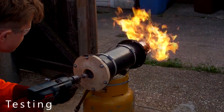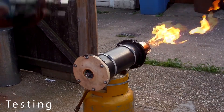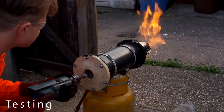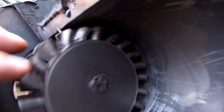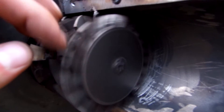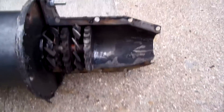The approach you'd need to make it work is to spend as much time and energy as possible on balancing the turbines — even the impeller I bought needs to be balanced. Everything needs to be perfectly balanced, because the main problem was that vibrations caused by the off-balance turbines were making it collide with the outer walls, which mashed the pieces. Even if it weren't hitting the walls, the shaft would never be able to turn fast enough to create enough pressure in the compressor for the jet engine to actually self-sustain.